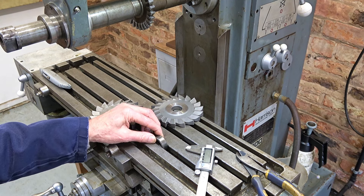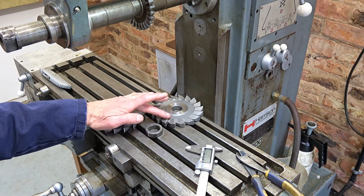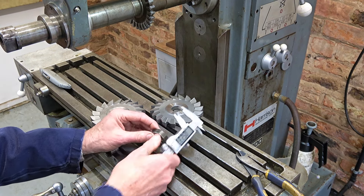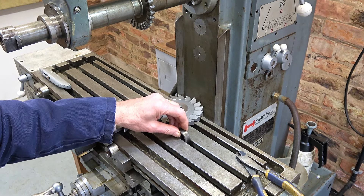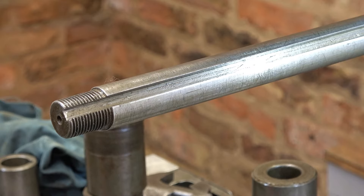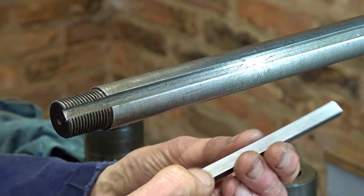I'm using a slightly under half inch spacer — someone's taken a half inch spacer and ground it a bit. Using a dead-on half inch spacer makes it obvious the blocks won't fit. I have some shims — stuff from Jason and Tony, thank you very much. Measuring, it's 0.496 inches: just very slightly loose on the main T-slot way and slightly tight on the other. The quarter key, which I bought new and is a quarter inch, won't fit in the quarter slot, so job for the surface grinder to take a fraction off.